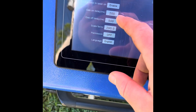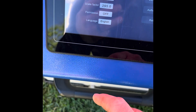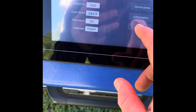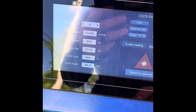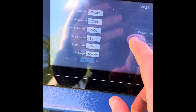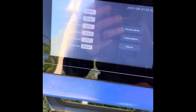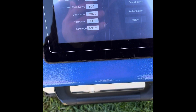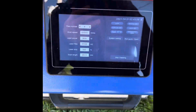You can set your gas delays - I just left them at stock. This permission setting is that lock I was telling you about. If you turn it on and return, you'll see the lock and then you can't use the machine. Even if you turn it on to cleaning, that lock is still going to keep it off. It's a nice safety setting if you've got kids walking around, or say you're out at a show doing examples. I'm not touching the language button because I don't want to struggle getting it back. Let's go back to return and get some things cleaned.